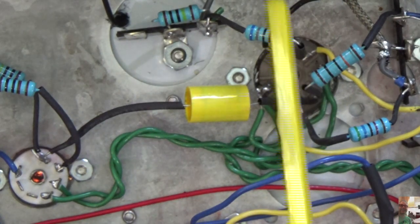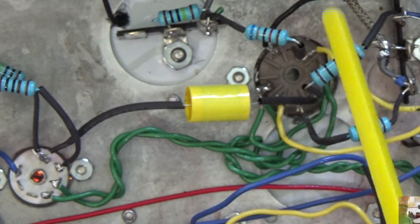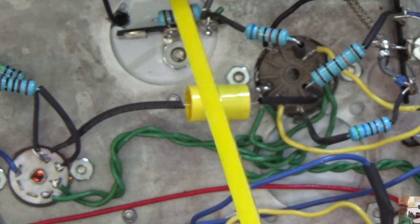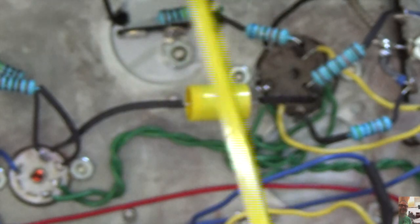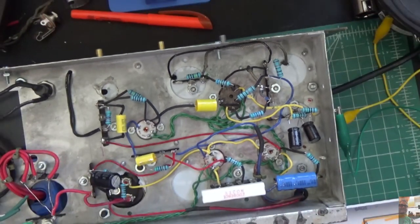I want you to listen when I tap the resistor. You hear that? Different than that one — it's coming through the speaker. That resistor is microphonic. How about this cap? That cap is as well. So what that means is that the 12AX7 is microphonic, or something around about the circuit is microphonic. I have tested the 12AX7 and it's fine. So it's not the tube.